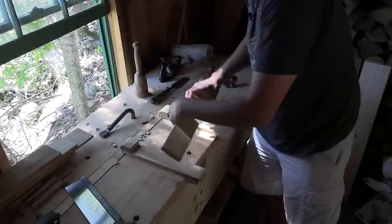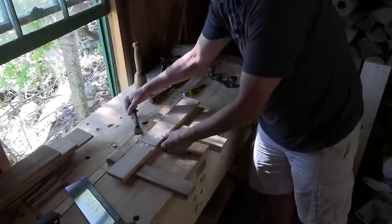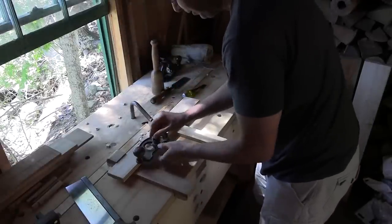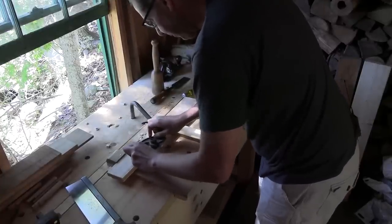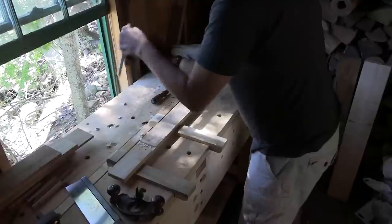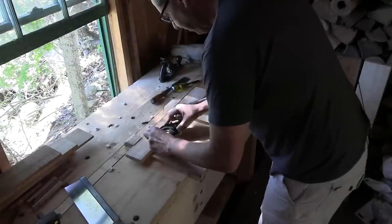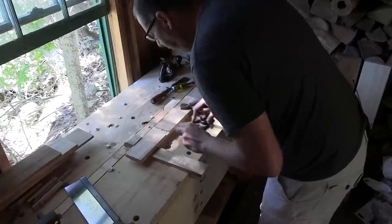Likewise, an operation that I do a lot that is two-handed is finishing up a, what's this thing called? A dado with a router plane. So now, I can bring my router plane to bear very easily. Finish this up. Now, this could be a situation where my hold fast is a little bit in the way. Now the hold fast is down here, completely out of the way. And I can use my router plane to finish off the dado